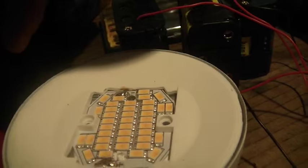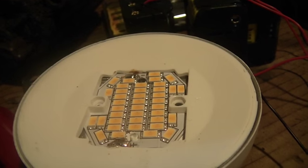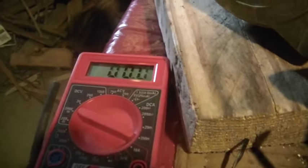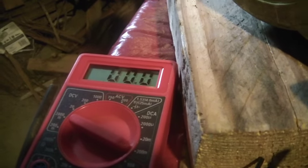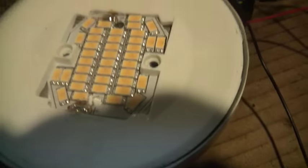So I duplicated that voltage: each one of these battery packs is 12 volts, so 12, 24, 36 — and we have the cool little array lit up. I've also got my meter here. When putting 36 volts into this I want to make sure I'm only putting about 20 to 30 milliamps of current through it, because if you put much more than that you smoke the LEDs. They were kind enough to even mark this positive and negative.